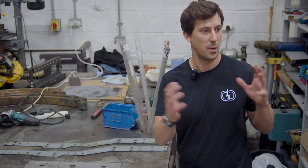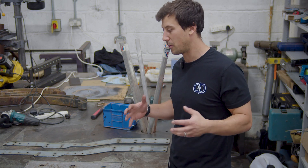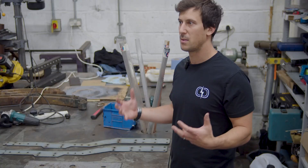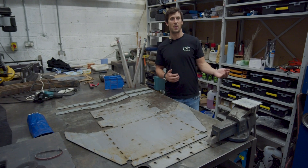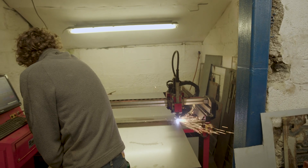The stuff that goes into our Series 2s and 3s in batch form is laser cut and CNC folded — we order it in batch, there's a lead time associated, it's more expensive but it's excellent quality and we know it fits. When we make the very first one we don't want to be ordering a batch because we could order several of something that doesn't fit or doesn't work properly.